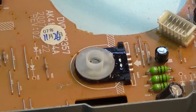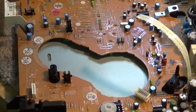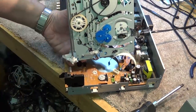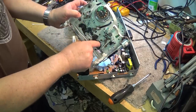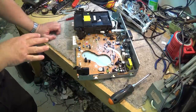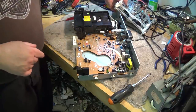Other areas of concern on a unit like this could be these tape sensors — these are your supply and take-up optical sensors. Basically how they work is: on the tape spools themselves, these tape sensors stick through holes in the chassis. There are slots on the tape spools, so as the spool is turning it makes or breaks the light beam shining from the LED to the photo transistor, and that tells the microcontroller whether the tape is actually moving or not. I don't think that's the issue here — from the symptom, I think it's going to be an encoder switch problem.